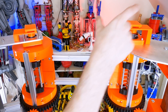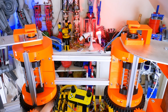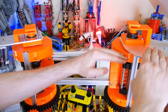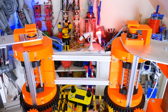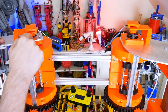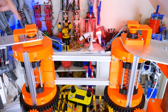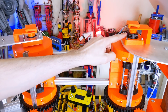We've got these encoder assemblies on the top — I'll have a closer look in a minute. I just wanted to point out that there are two bearings: one on top and one on the bottom. That's because this is hanging on this, so we've got a collar on top with a bearing in the top of the block to stop it slipping down. Then on here we've got the plate pushing down, so the bearing is underneath with the actual bearing resting on the metal. That's why this configuration is slightly different — one is shorter and one is taller to account for the collar.